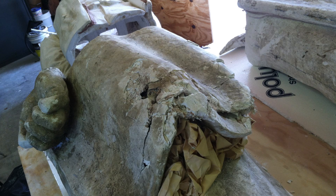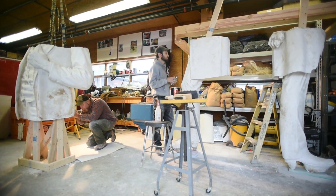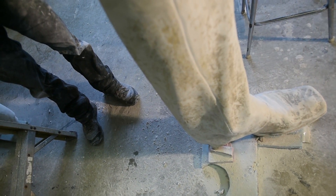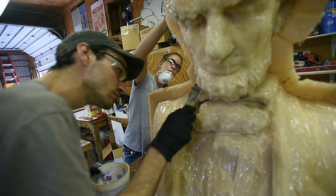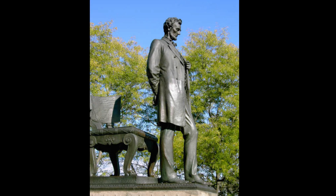They were stored in various places over the years, and with the anniversary of the Saint-Gaudens National Site coming up, they decided they would like to have a version of this statue cast at their National Historic Site. They were also concerned about the conservation of the patterns. So, due to the amount of decay, the first step in the process was to restore the plasters, after which point we make rubber molds of these restored plaster patterns. Those molds are then sent to the foundry and cast in bronze, and then from those bronze castings, a final statue will be assembled.